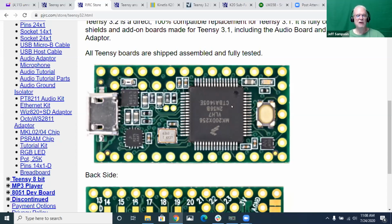So it could be that when you first turn it on, the Raspberry Pi will go out and enumerate all the USB devices. Well, it's not going to see this one because it has no power. But then once you turn on the servo, then it will work. So there's just little implications like that. But if you want the TNC to run when either is there, which is what you have right now, you also run the risk of burning something out by having the two supplies connected together.